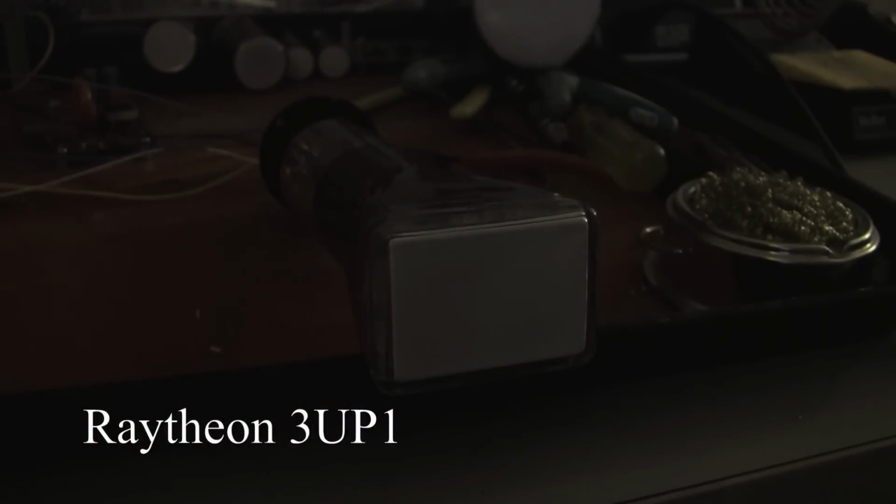I've just installed this 3UP1 on the high voltage driver board, and it needs to be aligned. The scope clock is driving it, so let's first see if we can find the traces. So I'll play with the positioning controls. Here's horizontal position. If I can get the screwdriver into it without getting electrocuted. Oh, I see something. There we go. There's something. Vertical position. There we go.